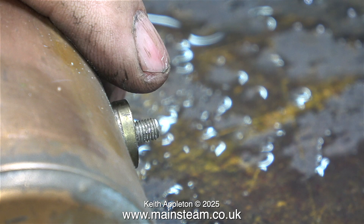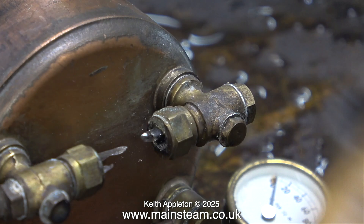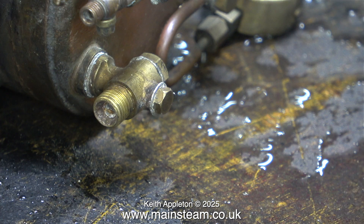As you can see from this clip, the stainless steel bit really is in good condition. Time to remove the water gauge glass from this other boiler. Same way as the first one, tap it gently with a hammer and the glass shatters. Once again though, a health and safety warning: wear eye protection when doing this, and make sure that you remove every particle of glass from the bench. I suppose I could have wrapped the gauge glass in some cloth before breaking it, but I like to live life on the edge.